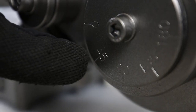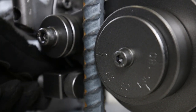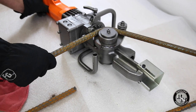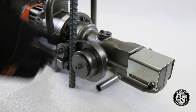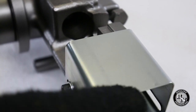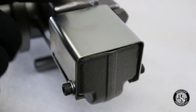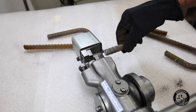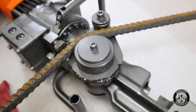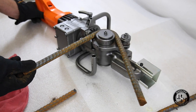These markings will help you bend any angle up to 180 degrees. The tool can be positioned in two different angles depending on the application. This safety guard will keep the cutter protected during bending operations. This powerful electric hydraulic tool can cut or bend up to number 5 16mm grade 60 rebar.